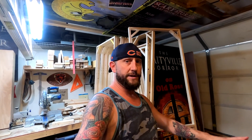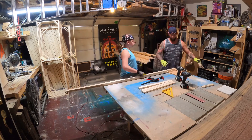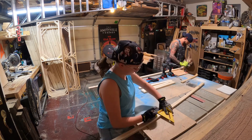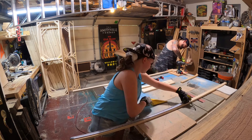I'm going to do some time-warp right now to show you the actual process of putting one together with Katelyn, with a little voiceover attached. Good news, I figured out the narration piece. So we use the one by twos, pre-drill all of our holes for mounting the panels together, as well as countersink all of our holes to actually connect the pieces together.